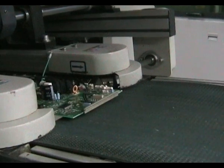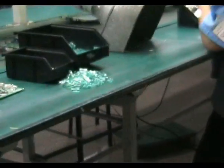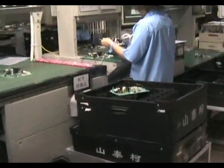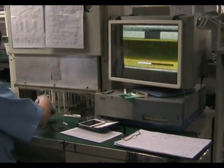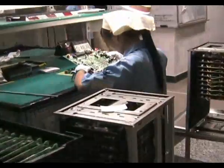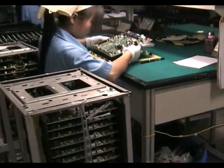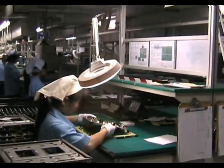There's a board actually emerging — that's a completely soldered board. It goes down the conveyor belt and along the next assembly bench. There are more components, mainly hand-assembled components, connectors, or other parts which are hand-assembled. It goes along an automatic conveyor belt. This is the automatic bed-of-nails tester — it's fully custom and set up for this individual board. It's a very quick and fully automated test, and the board is passed. It goes into final inspection, where the worker inspects the board for any missing components, using a reference template that compares the colour of connectors.